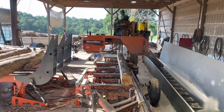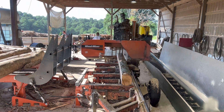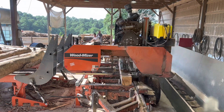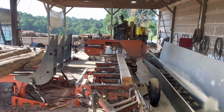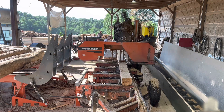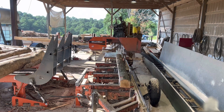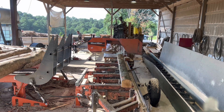That's seven and a quarter wide — should be able to go through that pretty quickly no matter what. But when you get in a wider log, you can really tell if your mill has everything correct. If you're getting something that's 13, 14, 20 inches wide and you're slipping your belt a lot, you could be going too fast. But you should be able to cut through anything, even the full width of the blade opening. And if you're not bogging your motor but you're slipping your belt, then you really probably want to check your pulleys.